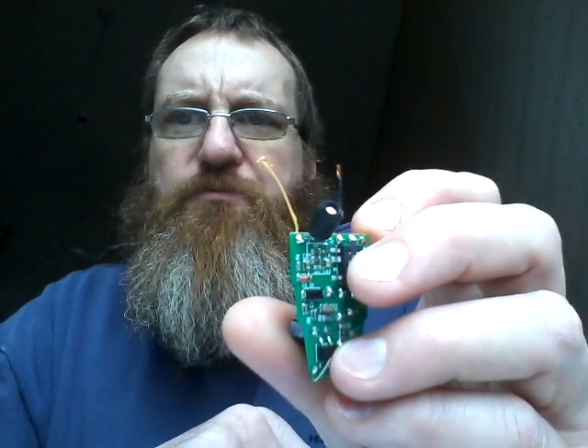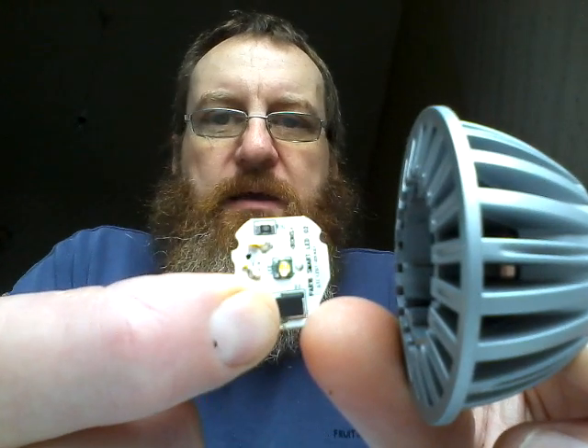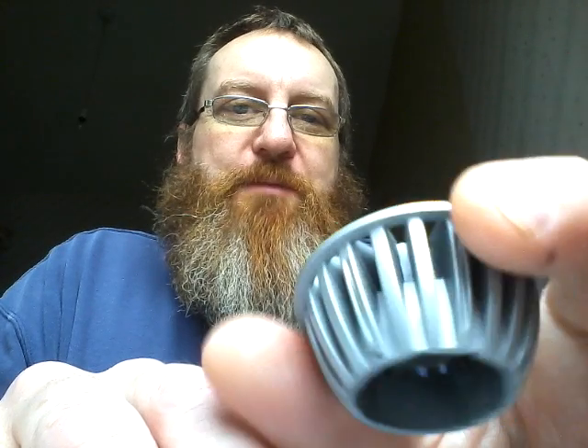So it's an unusual lamp. I don't really trust a heat sink this size to dissipate five watts from an LED this size. It's interesting, but it came from a shop that doesn't really sell top-of-the-range stuff. It may be that Osram were just moving some of their earlier concept LED lamps out, because by far the common choice of high-power LEDs these days tends to be the multi-chip versions.